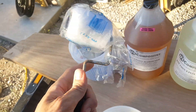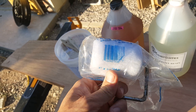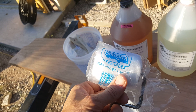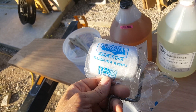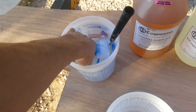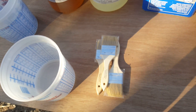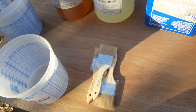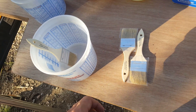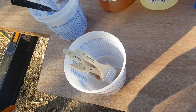We've also got a special nap roller for epoxy. You could probably use ones designed for paint, but US Composites told me these are actually better for fiberglass and Kevlar. You'll also want a ton of these brushes — I've got a whole box of them, pretty much throwaways. If you like to reuse them, fill a container with acetone and have someone clean them up after use.